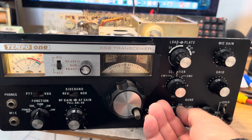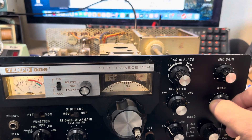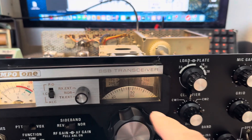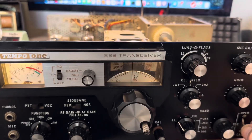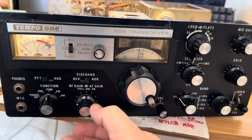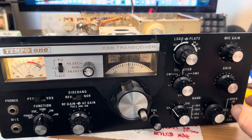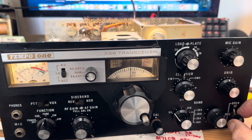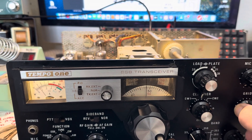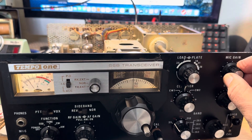Let's take it for a spin, at least transmit-wise. I'll start off on 80 meters — I'm on a real antenna now. Tune it for peak noise. I'm at the middle of the band, exactly where you want to do this testing. With this you take the mic gain down, tune it, you can take it up a bit and go for a peak.